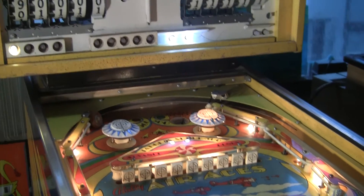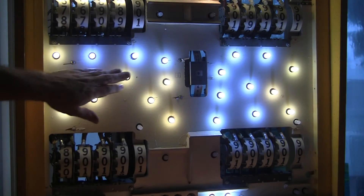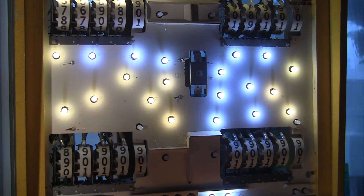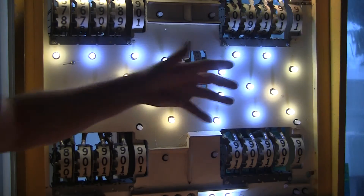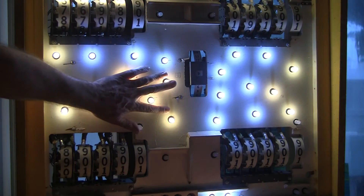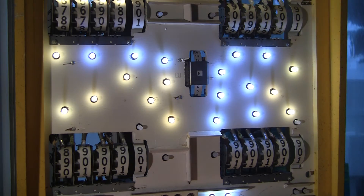So let's look at the back box. What you see here in the back box is a mixture of two different common kinds of LEDs. These are warm whites and these are cool whites or natural white. The warm whites have a little bit more of a yellower tinge to them and the cool whites have a little bit more of a bluer tinge. Light is measured in temperature in Kelvin on a scale. These warm whites are in the kind of 3,000-ish range, and the cool whites are closer to 4,000. The higher the color temperature, the more UV is in the light, which gives it its bluer color — more closer to daylight — while lower color temperature is more like the old-style incandescent bulbs running yellow.